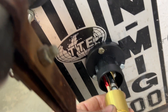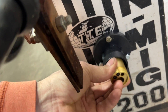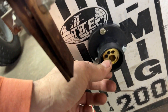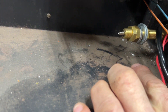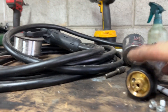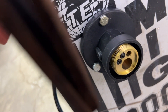I got the plastic housing mounted up. I just put a couple of quarter-20 bolts through for now with nuts on the back. I'm taking the euro connector, wiggling it around until I can feed it in there — it goes a little deeper than I'd like. So I'm going to need that bracket in the back. I'll make some sort of a steel bracket coming down so I can set the depth so the front of this will screw in properly.